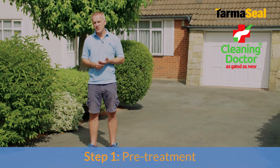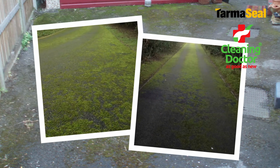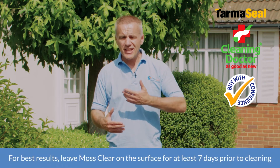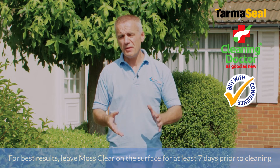So when I first visited the property a few weeks ago, there was quite a lot of moss and algae present on the surface, and it was important that before I tried to clean with my pressure washer, that I treated the moss and algae to reduce that, so that during the cleaning process I could clean with a very low pressure, which meant there was no risk of damaging the tarmac further.